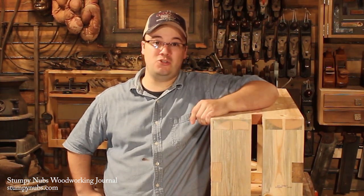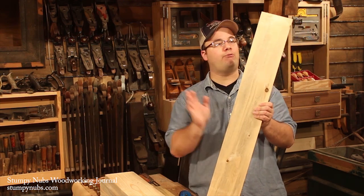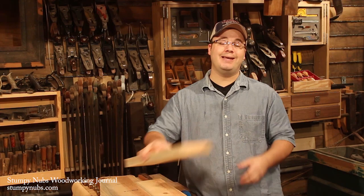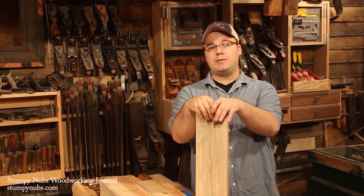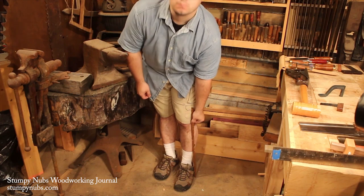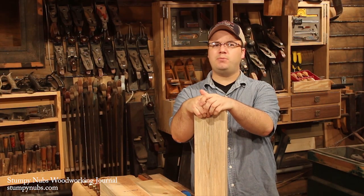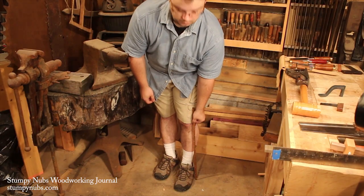You can make this whole thing with just a couple of 2x6s and one 2x4 — it only costs about $10. For me, 3 feet is just about right, so I cut a couple of 3-foot chunks from some 2x6s. I also cut four 19-inch long chunks. Why 19 inches? Because I measured from the floor up to my kneecap and it turned out to be 19 inches, which I believe is the perfect kneecap height. You should probably measure yours to be sure.